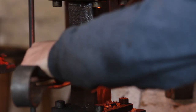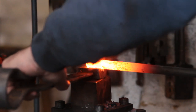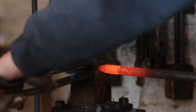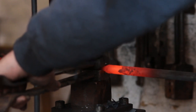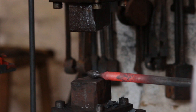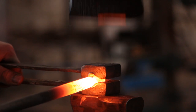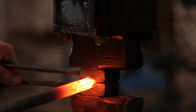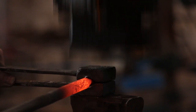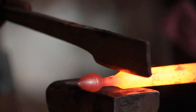I do this close to a welding heat with 16mm bar, just because it helps ensure that galls will close up if they do form. Because the edges weren't quite as rounded as I would have liked, you'll see it does gall a little bit, but it really doesn't matter at this stage because a second pass will remove those galls. For a more naturalistic approach you could leave those in because acorns tend to have these little lines across them, but in this case I'll take it out on the second heat. Letting it go down to quite a low heat will allow the swage to planish the work — and as you can see, that's lovely and smooth and even, so I'll just lop it off the bar.